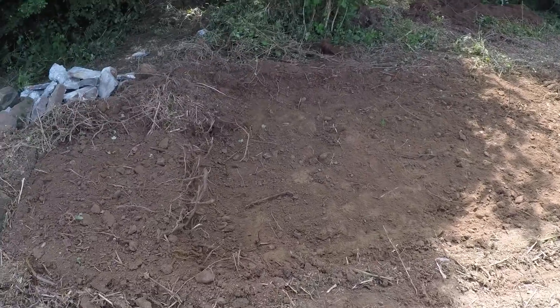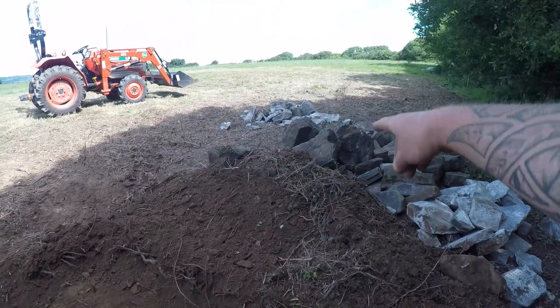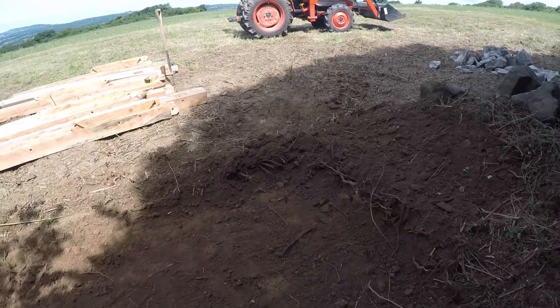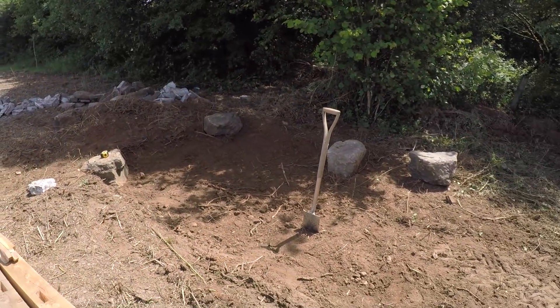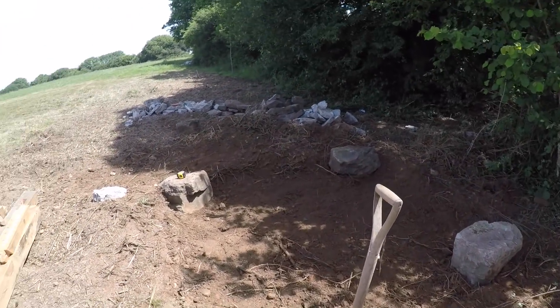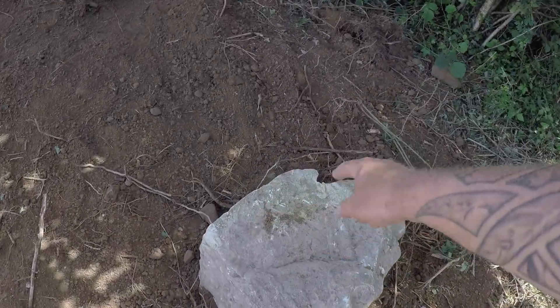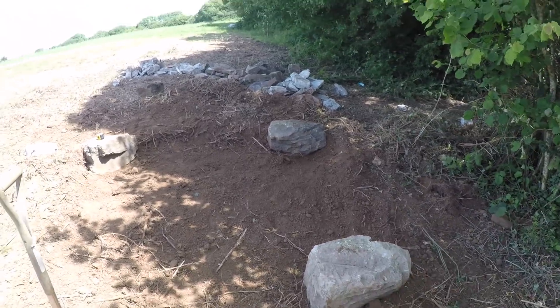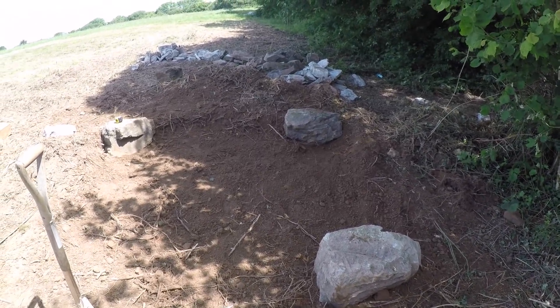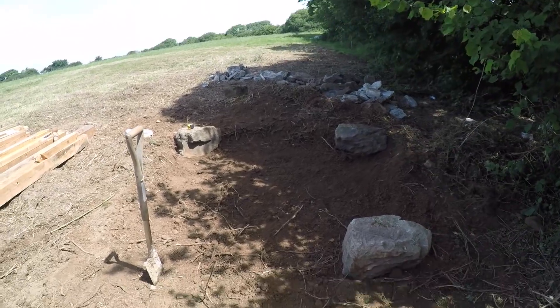I've just cleared off the topsoil here and leveled it out a little bit. The ground gets quite wet in winter, so I needed to go below the topsoil. Now I'll put in some stones which will support the weight and build the building on here, with a path coming in from each side. It's really windy up here — I've seen about 80 miles an hour before — so I need to put in some pretty significant mass around the bottom so it doesn't get blown away. I'll fix the posts with some angle iron and fill in a stone wall between them to bond it all together.